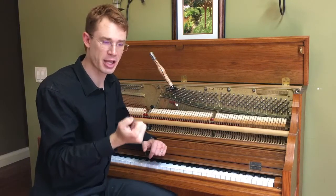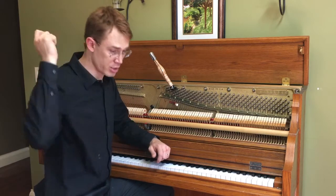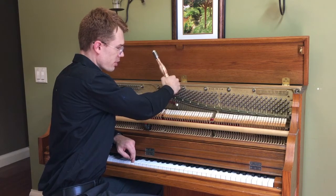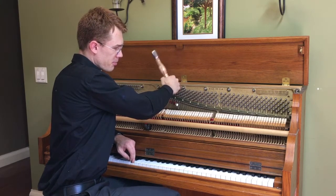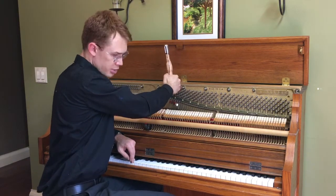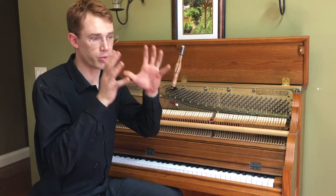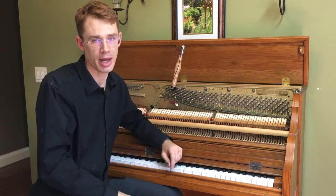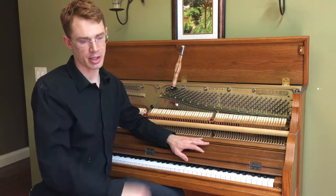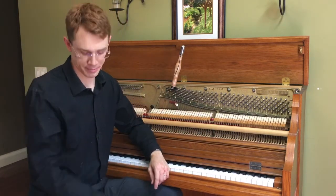Yeah, the experienced caveman who's taken down a lot of saber-toothed tigers, he's got this loose grip on his club, and he just flicks it. But we've got the same concept here. That escapement is so critical. Don't aggressively participate in that impact. I just can't say that enough. Do not aggressively participate in the impact. You lose all your power, you lose all your control, and you experience the damage instead of using this brass weight and this cam mechanism to do the work for you.